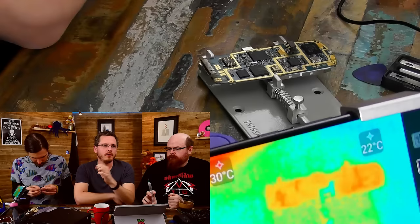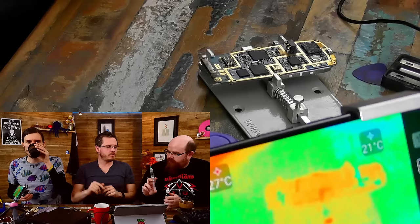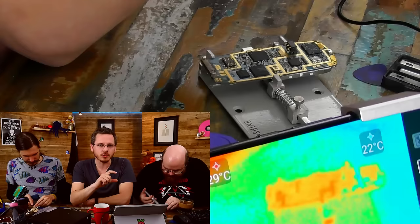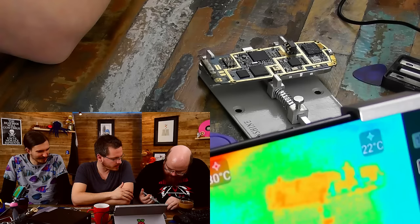You need to be really careful with SMD components — they have different pitches, different packages, so many variables. They are an absolute minefield. Be really certain that your breakout matches your components. If you're designing your own PCB, really check the datasheet, make sure you know exactly what the landing's meant to look like, and almost always produce your own landing — using stock ones is an exercise in frustration.